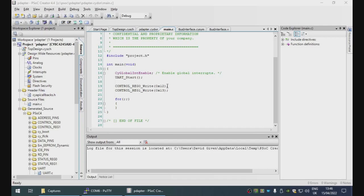Okay, it is the next day. I am reasonably refreshed. Let's do the software side of things. Now, we have two registers, effectively. We've got the status and control registers. Index 0 is going to be the data register. So when the Brother writes to this, it's going to be sending a byte, and when it reads from this, it's going to be receiving a byte. Register 1 is going to be the control register.